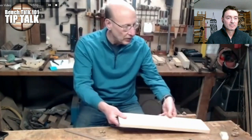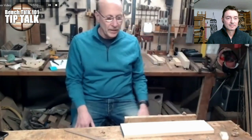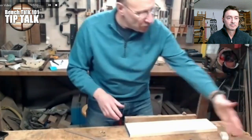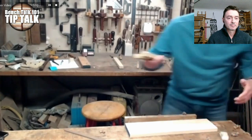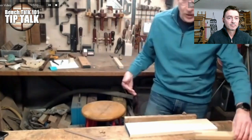If you're dealing with small, cabinet-sized stock it works fine. But if you need a large piece — planning a tabletop or a big raised panel — you need something better than just a simple stop. You could have a pair of stops, a board going across, or just grab anything off camera — a board with a V in it, clamped down — and work against it.